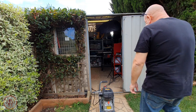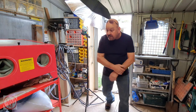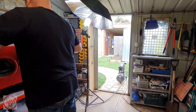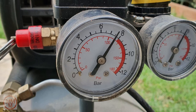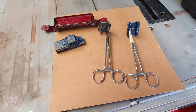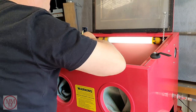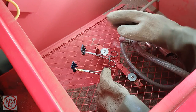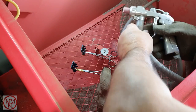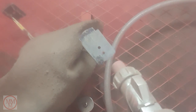I have been watching the El Chapo documentary on Netflix — he's a drug lord if you remember. Anyway, it's going to be a combination of 50-50 garnet dust and glass beads, just to see if it makes a difference. I know there's loads of different types of blasting media out there and I'm still experimenting. I do actually believe that I need to upgrade my compressor at some stage because it seems to run constantly — and they're not supposed to run constantly. It struggles to keep up the pressure at 100 PSI.